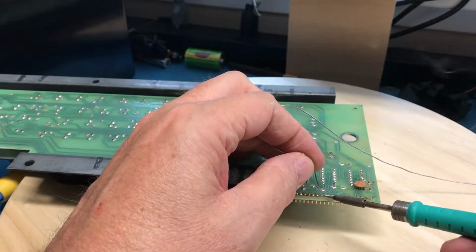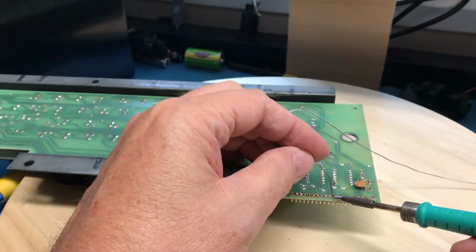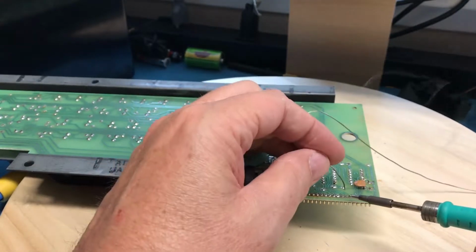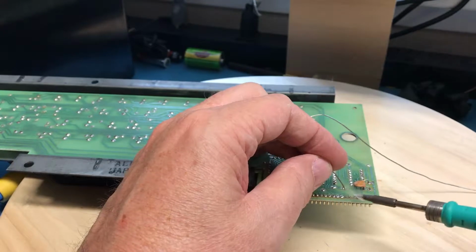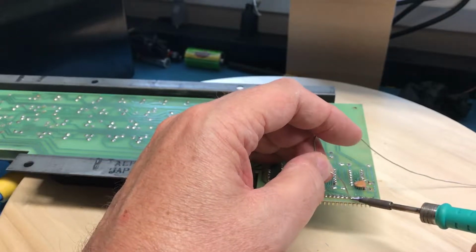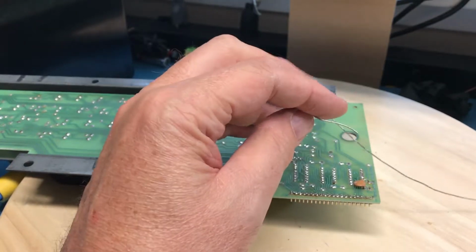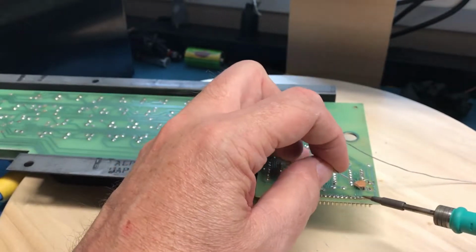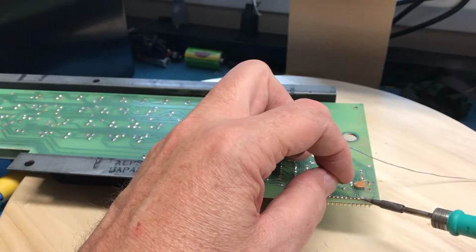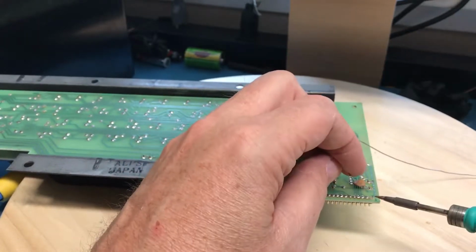It's interesting that these don't really have any connections coming to them. Those couple of pins. Neither does this one seem to, and I believe, well, I know this was completely single-sided on the other side, so there are apparently some unused pins here, but I will still get some solder to flow down into the plated through holes, just to add a bit of mechanical strength. There's really no stress relief the way I'm doing this, and I wouldn't be surprised through use if I didn't get a cracked solder joint here that would cause keyboard issues. But again, I am intending to use this machine to modify.